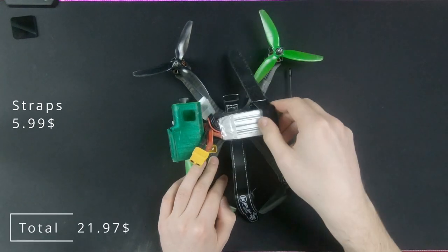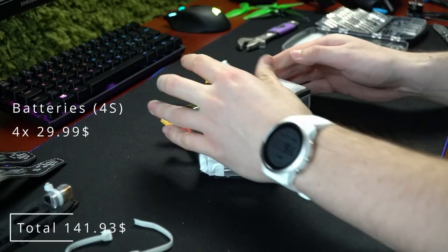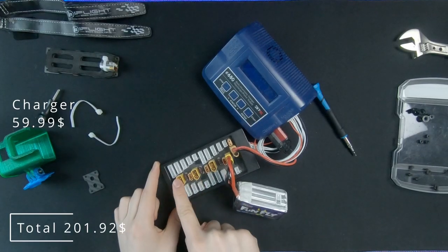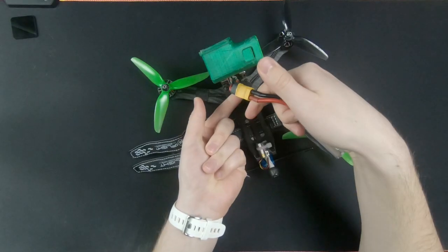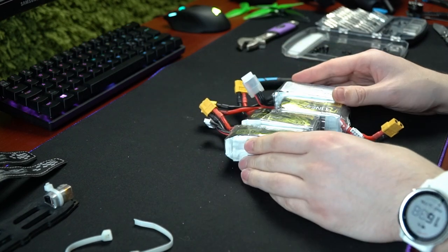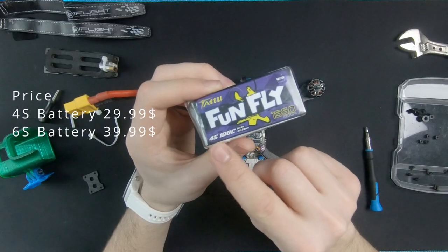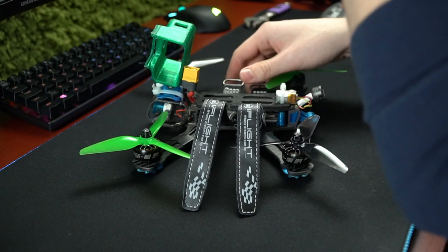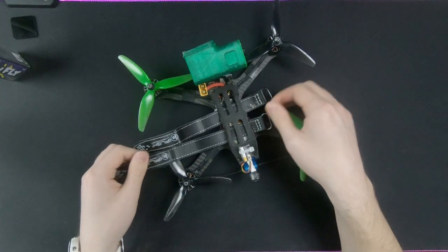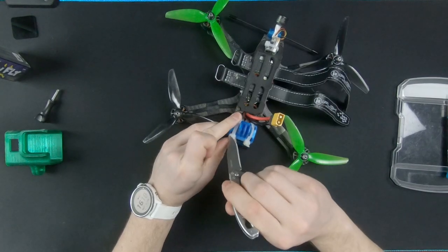Then there is the battery, held in place with a couple of straps. This is a 4S battery from Tattu. I really like them — they are on the more expensive side, but very durable. To charge all of the batteries you need a special type of charger like this one. Something you need to consider before building a drone is if you will have a 4S or a 6S build — meaning a more powerful 6-cell battery or a more widespread 4-cell battery like I have here. That decision affects your choice of the electronic speed controller. The straps are made from leather and are much stronger and more durable than cheap plastic ones, so you can be sure your battery won't fly off during a hard turn or a flip.